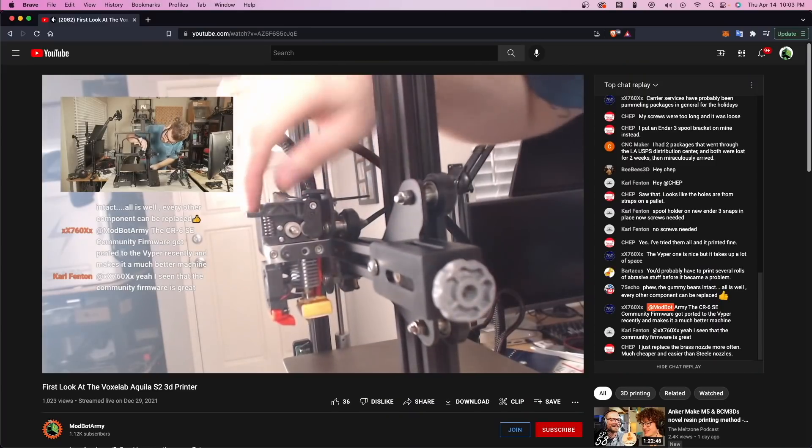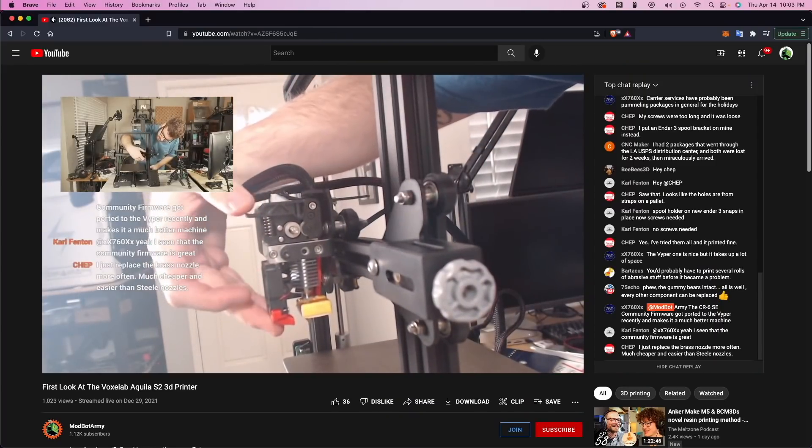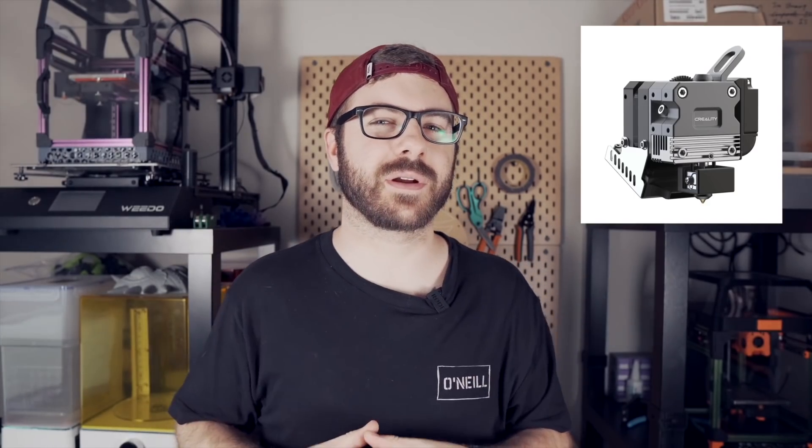With all that said, the S2 definitely has some things I'm not crazy about, starting with the extruder. I like that it's direct drive, but it does not get any more bare-bones than a single-geared plastic extruder — especially one that doesn't seem to have any way to adjust tension. With so many other manufacturers using BMG or Aero clones, or Creality with their new Sprite extruder, it's hard to understand why on a new machine you would go with such an old extruder design. Yes, it works, but it is really bare-bones and I think they should have shown a bit more love there.